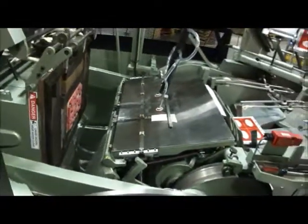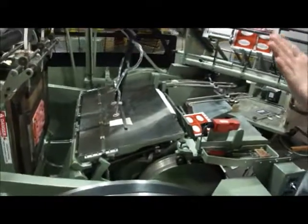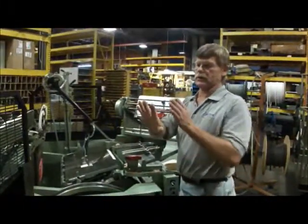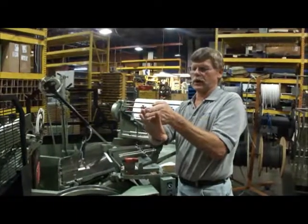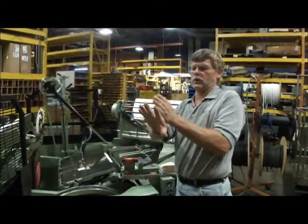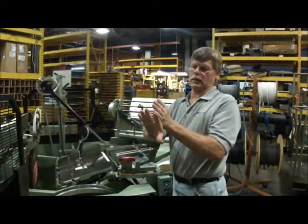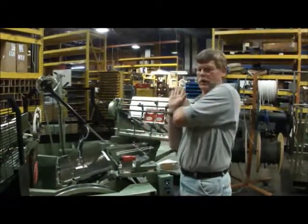So it's important to have ejection rubber all the way around your images when you want no nicks. Ejection rubber does exactly what it's called — it hits the stock first, the blade comes through and does the die cutting, but it ejects the sheet to hold it perfectly flat as the machine opens to get the blade away, and then the ejection rubber lifts off.